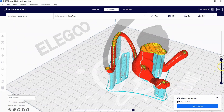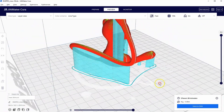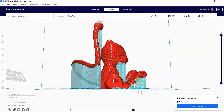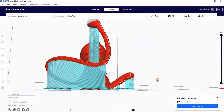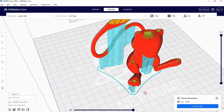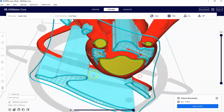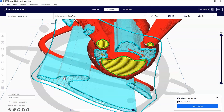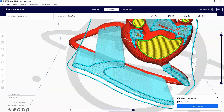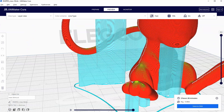The second problem is that as we go up and down, the supports aren't supporting all that much — they're only supporting thin parts, and you're relying a lot on the printer's overhang ability. Especially on that thin tail, you might want to increase the support angle. Third, notice the bottom: the Mew itself has plenty of surface area on the build plate, but the supports have almost nothing touching the plate. Whenever I have lots of isolated supports like this, I like to include build plate adhesion like a raft or brim.